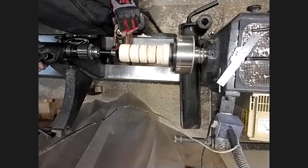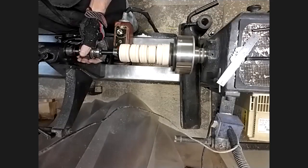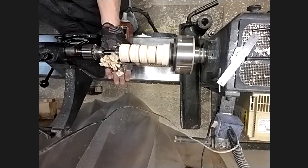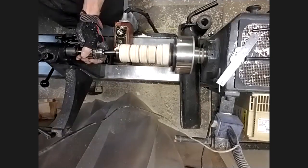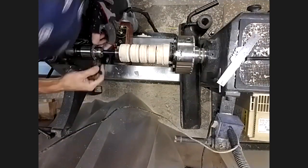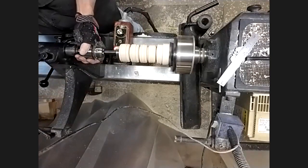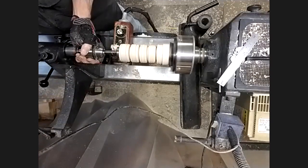Control box over. I drill approximately 300 RPMs. Gradually. So you can see the shavings coming off. That's how you know you've got a sharp bit. However, it's still not tight enough. See it twist. A little bit, back it out. Cut a little bit, back it out.